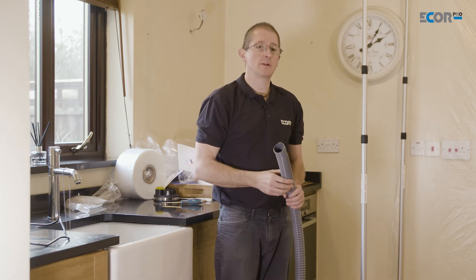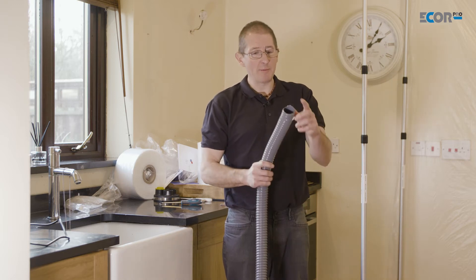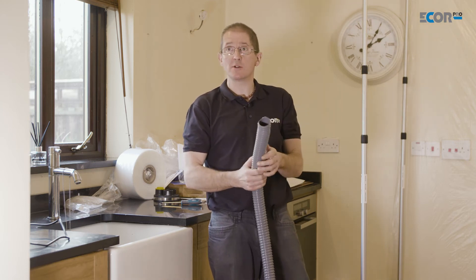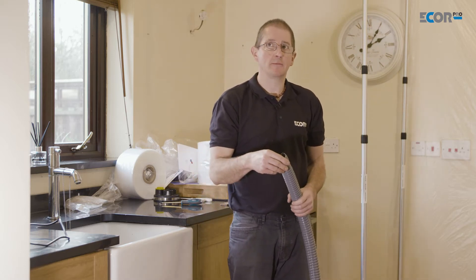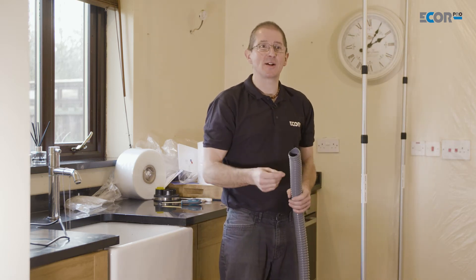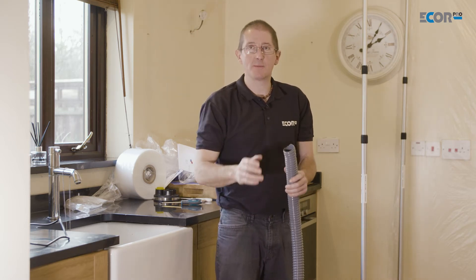They haven't got an air conditioning unit. Well, have they got an extractor fan somewhere? Most showers have got an extractor fan — can we put the exhaust against the shower extractor fan and turn that on? Because if we can, the fan would take that humidity out and it's designed to do that job anyway. If they haven't got a bathroom extractor fan, have they got a kitchen extractor fan? The kitchen extractor fan is designed to remove humidity, so we could take this pipe, put it to the extractor, turn the extractor on, and the humidity is purged from the building.